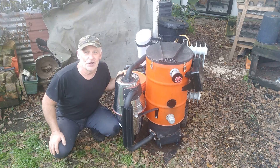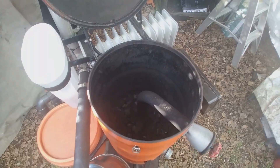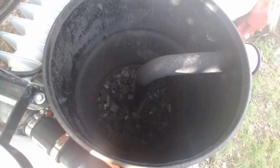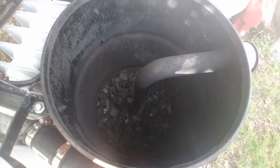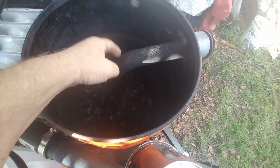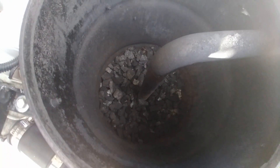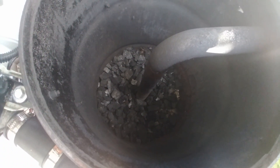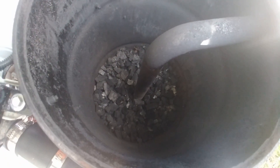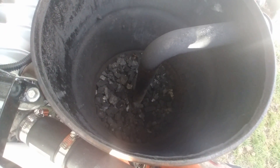Let's start right at the beginning: the fuel hopper. The fuel hopper could be pretty much any size — I've opted for a 60-litre drum so that it keeps the thing a little more portable. Down the center runs the air tube, which is the main inlet of air — more on that in a moment. The fuel needs to be a nice quality graded charcoal. You don't want big lumps and small lumps; you want everything to be uniform so that it flows through the reactor in a smooth and controllable manner.